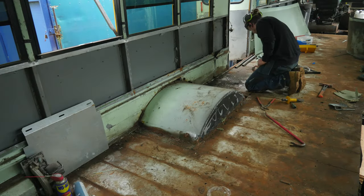I've been giving a lot of thought on what to do with my wheel wells over the past couple of days. I think we're going to go for it — I'm going to lower them by at least two to three inches. Once lowered we'll still have about seven inches of clearance when the suspension's down, and about ten inches when the ride height is up. I still think that's enough clearance, so I'm going to get on and start cutting this thing out.